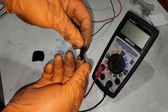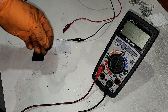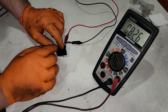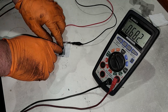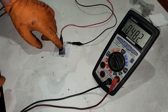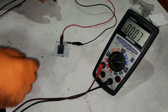Here are some numbers. Using salt water mixed at approximately 25 grams salt to 100 milliliters water and regular aluminum foil, all at a room temperature of 21 degrees Celsius, this new cathode puts out 0.6 to 0.7 volts and 16 milliamps. In comparison, a piece of plain graphite sheet of comparable size under the same test conditions puts out 0.5 volts and 8 milliamps, clearly demonstrating this cathode is able to hold its own against my previous best material.